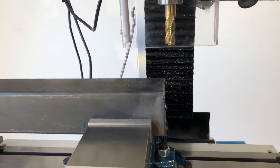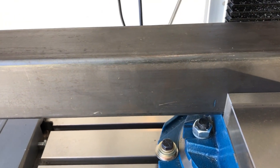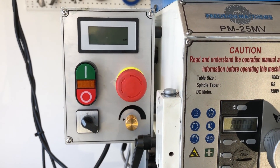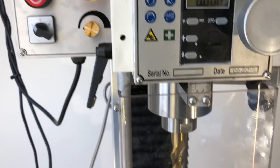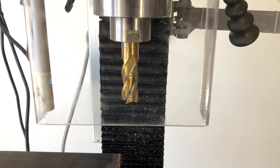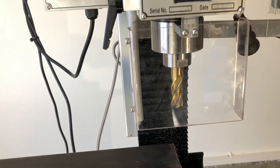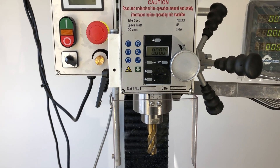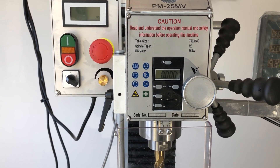My plan is to put the three and a half inch square tubing directly in my vise. I made the vise perpendicular to the table so that I make a straight cut. For RPM selection, I use the formula: surface feet per minute times 3.82, divided by the cutting diameter. My cutting tool is part of a kit from Little Machine Shop — it's high speed steel, and I'm using 100 surface feet per minute. So: 100 × 3.82 ÷ 0.75 (the cutting tool diameter) comes out to 509.33, and I set my RPM to 511.